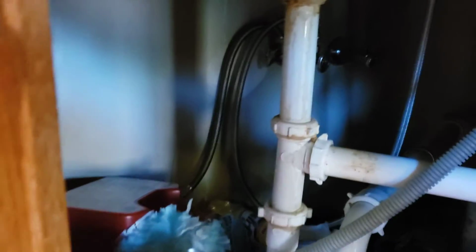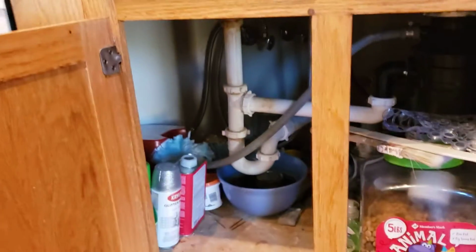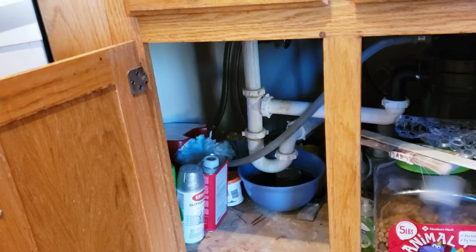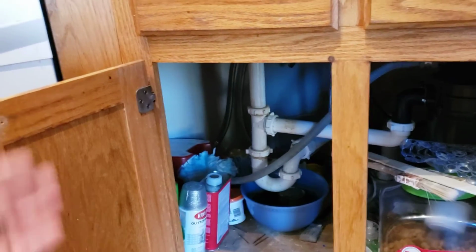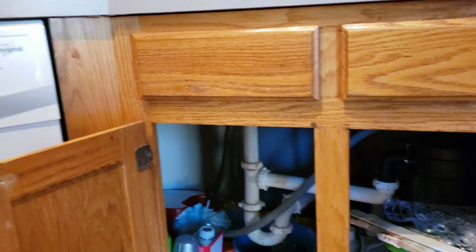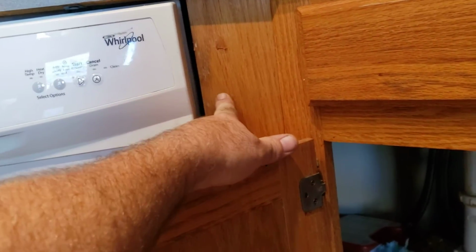And the reason is because if you look back here, all of your plumbing is all the way back. It's literally in the corner of the room, okay? So this has to be a cabinet front only, which would be probably a CFO 24 with extended style left and extended style right for us to be able to build this to the 29 space and have plenty of room. It could probably be a 27 extended style left, extended style right of 3, and that way we could have it. But this panel right here has to be a dishwasher return panel.